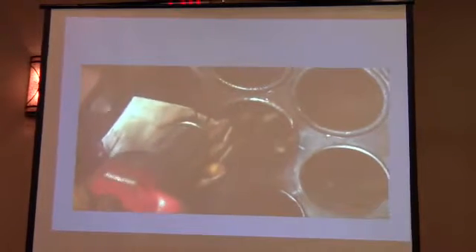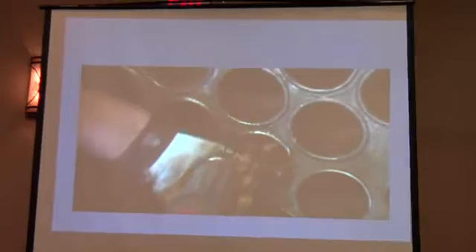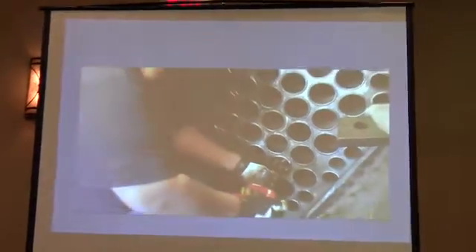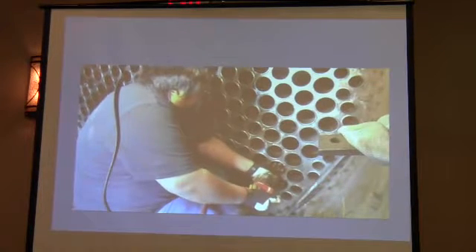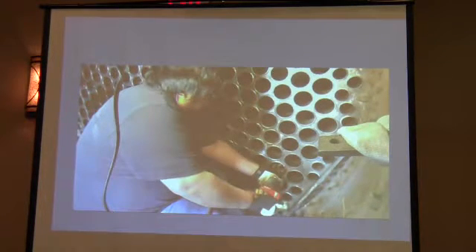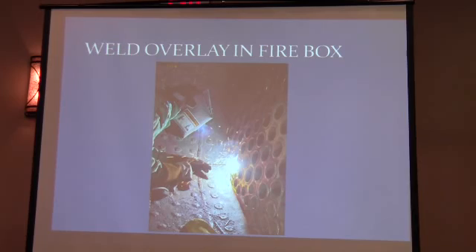And so it's noisy. Anybody notice there's a rag inside the tube? Well, if you use one of these air hammers, the tool is loose — it's bouncing back and forth off the work. And if he slips and brings the hammer into the bore of the tube, it will throw the hammer all the way through the tube. And there's a guy working on the other end who might collect it. But if you've got a rag in there, it stops after a few feet and then you hook it out with a stick. Once those beaded rims are done, you clean them up.